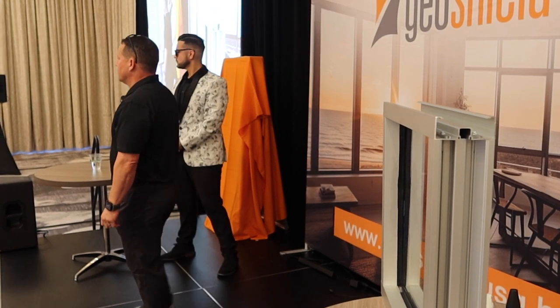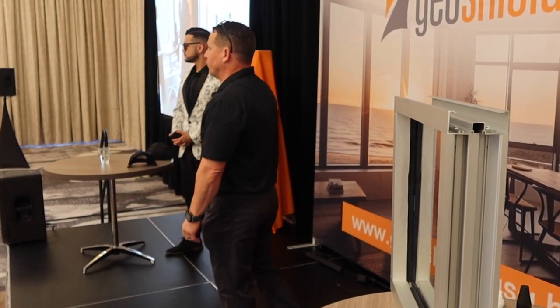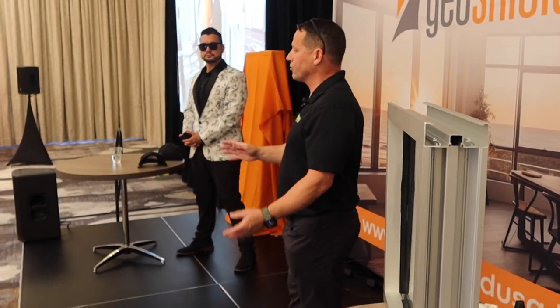How long do you have before you take the tape off? Immediately. Immediately? Yes. So on larger windows — as fast as you can. If you're in direct sunlight, you have a working time frame of about six minutes before it starts to skin up on you.